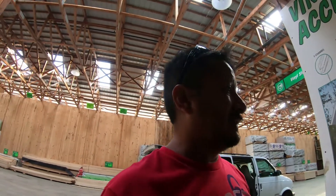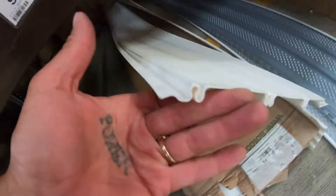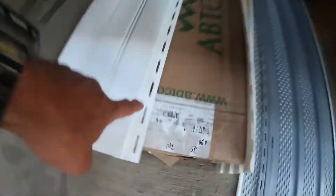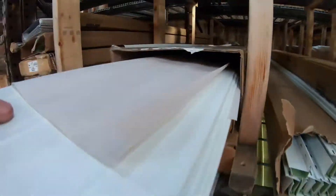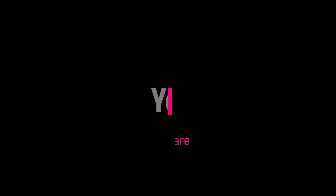So I went looking for the soffit stuff — here's all the soffit stuff you can get. Here's the F-trim right here: it would be nailed in like this, and this little hook right here is where the soffit panel gets popped into. This will get nailed across the ceiling at the top, then screwed in on the outer edge. Over here they have the fascia — you nail this in and it covers the outer end piece. I'll be doing this soon enough so I'll show you when I get to that portion. See you later.